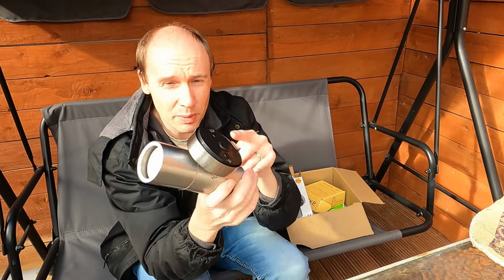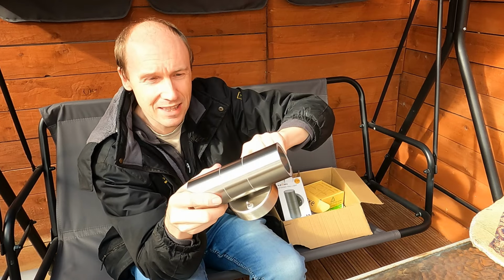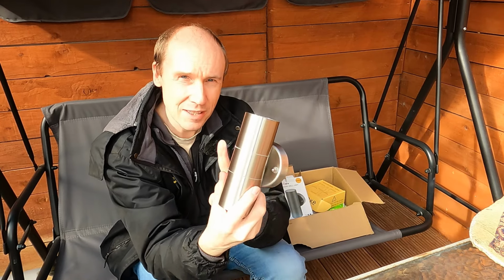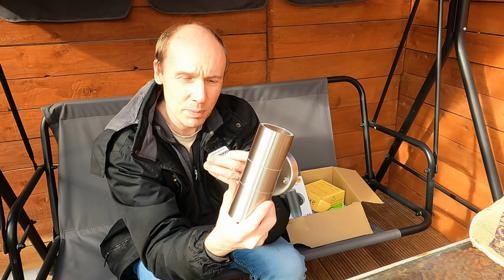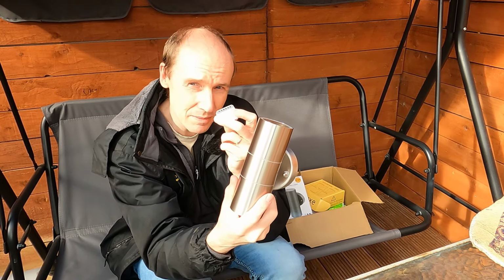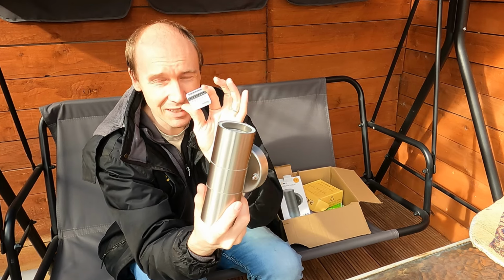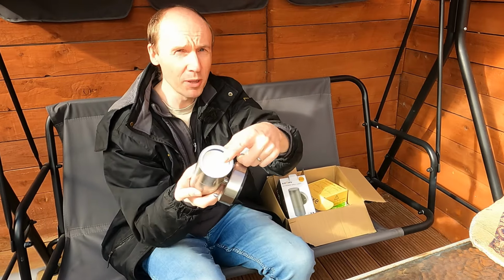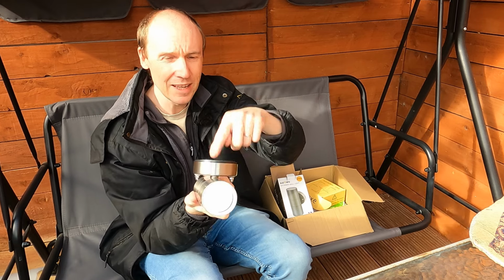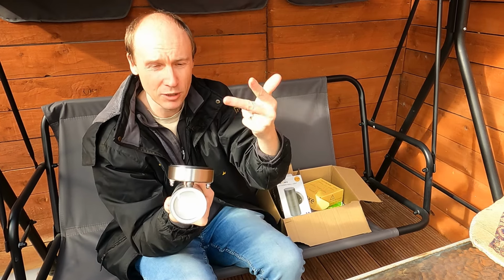Unfortunately, I did actually hope I was going to be able to hide it in here. I might have been able to hide it in this section, but I thought actually the stainless steel will block the signal for the Zigbee, and that might not work very well. So I think maybe this being on the inside of the switch is going to help things out. So I've put the bulbs in already, you've seen that. In the back of here we've only got 3 wires, very simple: live, neutral and earth.